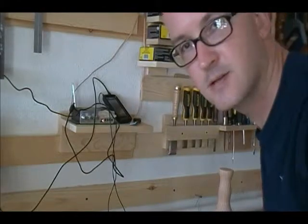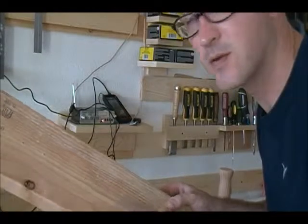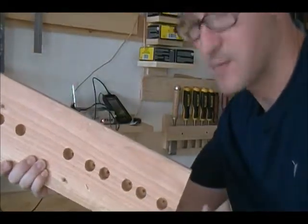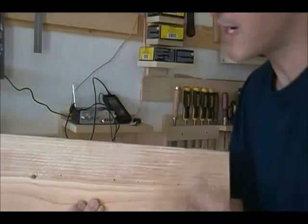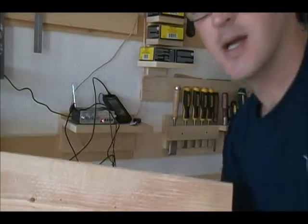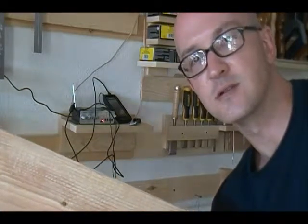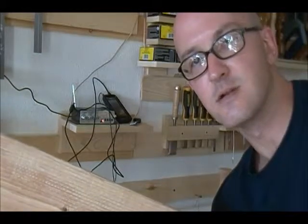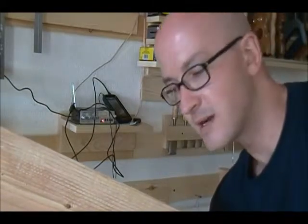So now I'll show you what I've got so far. Here we have the board — the holes don't go all the way through. I've already drilled the holes spaced to where my clamps will fit. I didn't go all the way through because I'm going to glue this. There are a couple small holes in the back, but I can tape those up easily. That's going to allow me to insert the glue and move it around before I insert the dowels, keeping the glue inside rather than falling out the back.